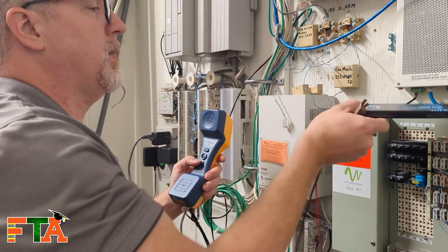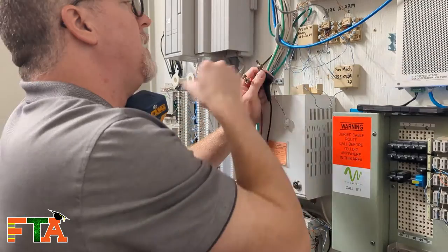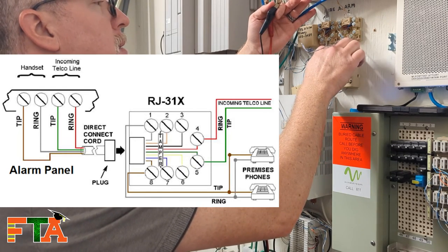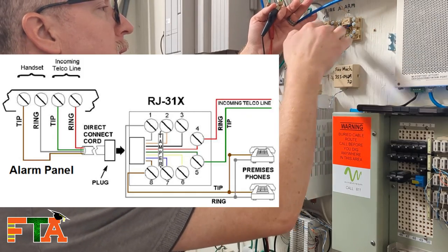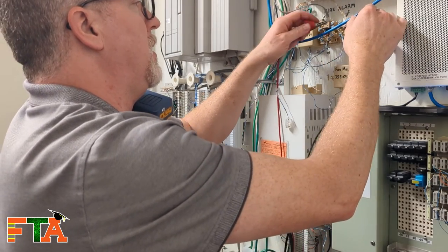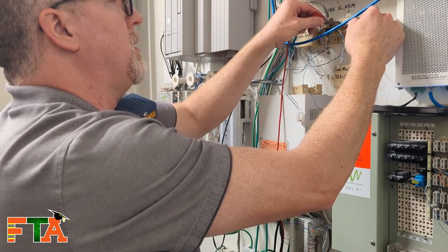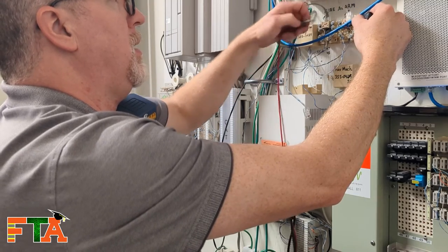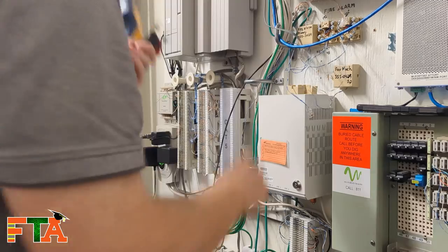What I'm going to do now is test for dial tone. This pair goes to the bottom. I've got dial tone there. Don't have dial tone coming out. This is that jack I was telling you about for security systems. This is the source from the phone company — it comes into this pair, and it's an eight-conductor deal. The idea is that this jack can seize control so that it doesn't go back out to the next in line — it's almost acting like it seized the line. I have dial tone in, no dial tone out. I have dial tone coming from the telco, but no dial tone here when this is plugged in. When this is out, I have dial tone. So when this is in, it's killing the dial tone — it's clearly not letting it flow through the system.